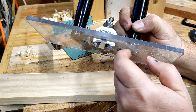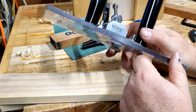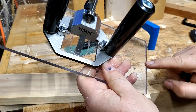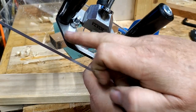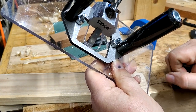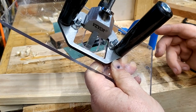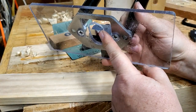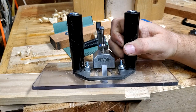I don't have any eighth-inch wood or plastic handy. I'm going to look around and see if I can find something. With an eighth-inch plate, I don't know if I could extend it out as far on the sides and still have it be stiff enough, but I think it will fill the hole. So I'm going to go try and find a piece of eighth-inch plastic and make a base plate out of that. Then we'll see how much extension we really get — probably about half an inch, which would be much more useful, because as I sharpen this it's going to get shorter and we'll run out of depth.